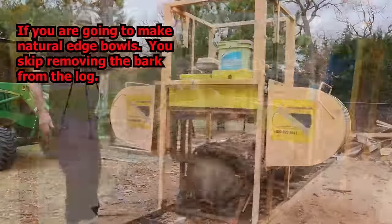All right, after 6.2 hours of processing these bowl blanks all the way from when we started cutting them on the sawmill to the time they're laying on this table and fully anchor sealed, we're done with these bowl blanks. They just need to be labeled and put in here on the shelf. Between all of these operations that got us here, I explained what happened and how to do each one of them. What we get out of this operation, the new way of turning bowl blanks, is really fast production in producing these 56 bowl blanks. At the same time, we get a better quality bowl blank out of it by using this method. So it's quick and it's fairly easy once you get it down.